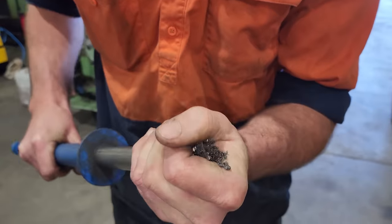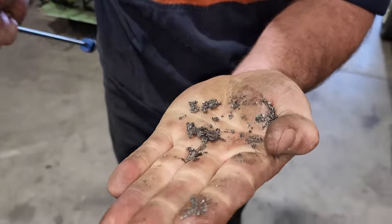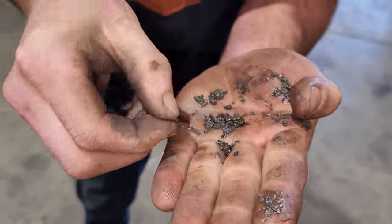The original rods from factory are dip chromed, which is a chemical transfer process. At some stage of this cylinder's life, it has obviously had damaged chrome on it and needed to be repaired, and the customer has used HVOF. Unfortunately, we do see this quite often with HVOF. All it takes is a stone chip or a dint in a cylinder for it to start coming apart.